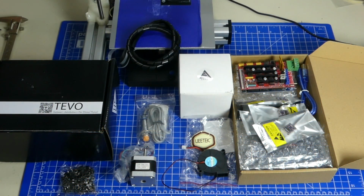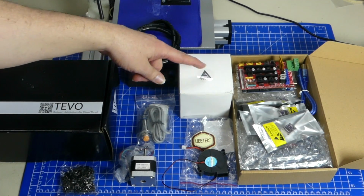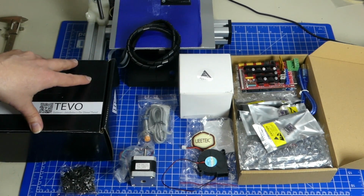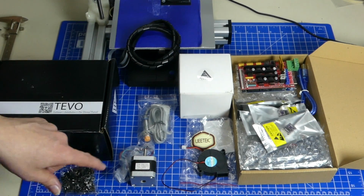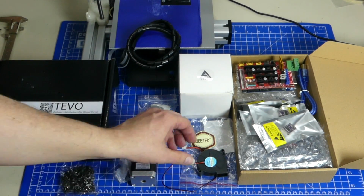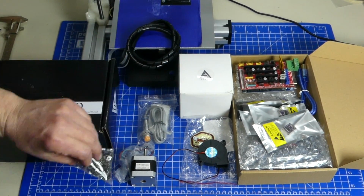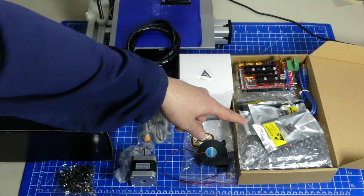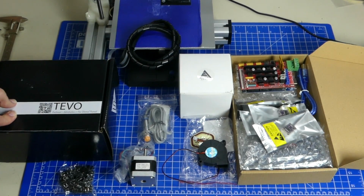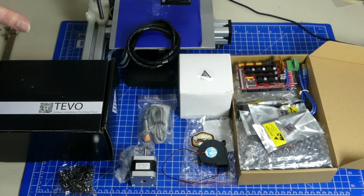These are some of the other components that I quite frequently use. It's the Titan extruder, it's the E3D V6 hot end kit. It's the standard inductive probe. It's an NPN, normally open. Steppers from the Longs Motor Company. A turbine fan, 50 millimeters. Cheap switches for controllers. I use these as end switches. They work quite well. And quite often I use a RAMPS kit with display and controllers. And I do prefer the Allegro controllers over the other ones just because they're a little bit quieter and I've had less problems with them.